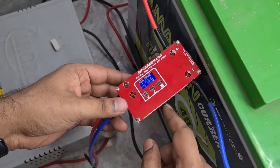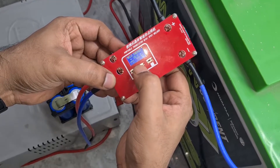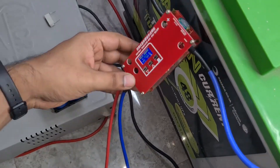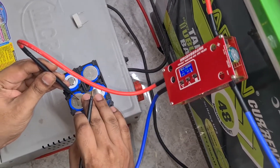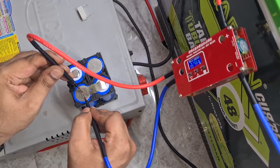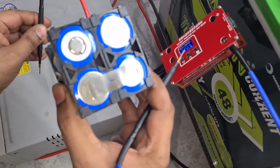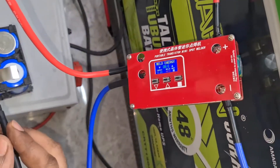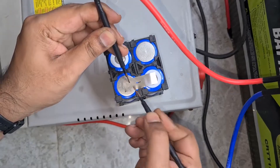After these two mods it started working quite well. Let me quickly assemble this and connect it to my battery. I've connected it to my inverter battery, set it to manual mode, and set the joules to five. Once we hold the tips together it should spot weld — and it does! You saw the spark, which means it's working. You can see two dots — those are the spot welds. Let me increase the joules to maybe six.